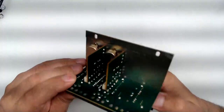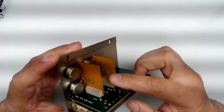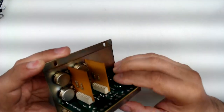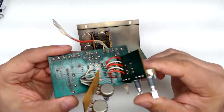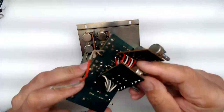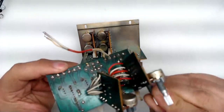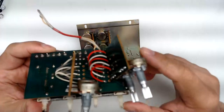Additional issues I've noted with this assembly include the data board connector to the main board here, which are also known to cause issues. Desperate owners and technicians have actually eliminated them altogether and ran wires in some of the units I've come across. This is not a unique case — I've seen maybe half a dozen units with the original connectors fully bypassed.